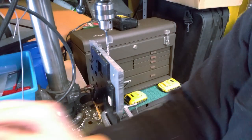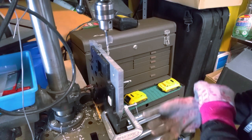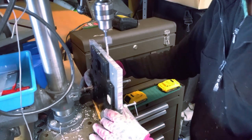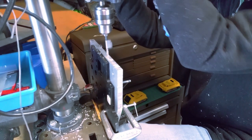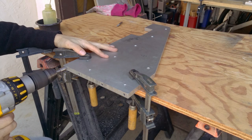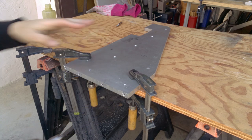Oddly enough, for these eight bolts this seems to be working. They're fairly straight, probably within a degree or two. I'm going to keep on doing this until it's done. This is not exactly a safe operation - I tried clamping this and it's really convenient. I have to push pressure on this so I don't recommend you try this at home. I have a cordless drill in the countersink - I'm going to get the holes a moderate amount of counter sinking so it starts nice and straight.